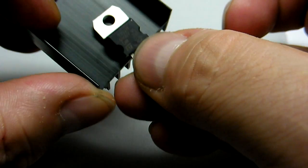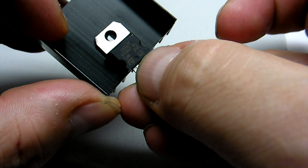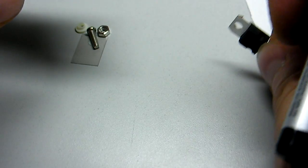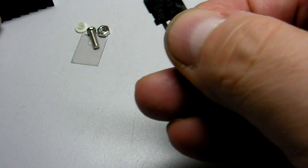But if you screw it directly like this, there's a very big chance that you make your heat sink carry whatever your plus volts is, which can run the risk of shocking people.